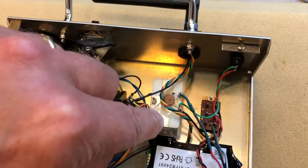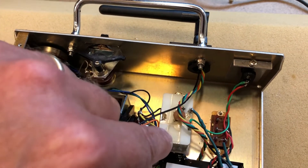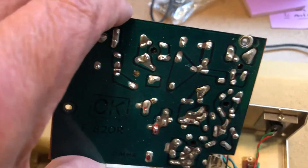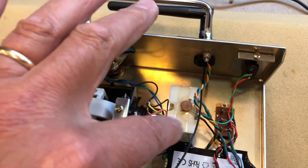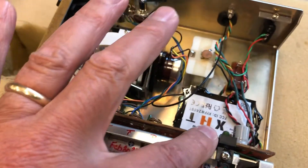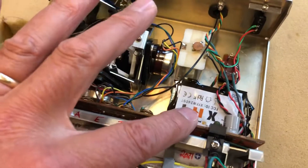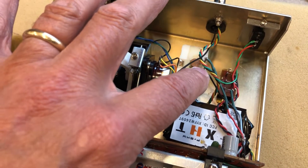One other thing I did was to make the meter work. The meter normally worked off the signal from the original 72MHz card to show the power of the signal going out. What I've done is converted it to basically monitor the power of the battery. There was a power lead coming off from this module that went to the original 72MHz card.